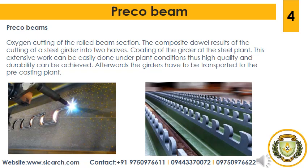Thus the materials can be used in an effective way from the beginning. The prefabricated girders can be transported to the construction site due to the comparatively lightweight construction, and the elements can be transported as usual. The girders are placed on the abutments, and the proper fabrication of the elements at the plant avoids problems on the construction site. Finally, the in-situ concrete can be added without any additional formwork, as the prefabricated concrete acts as the formwork.